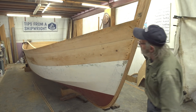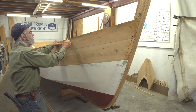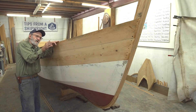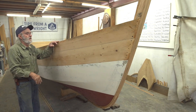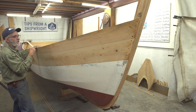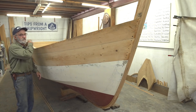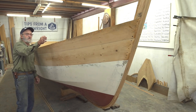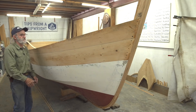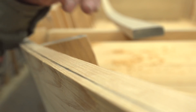Right over here I've drawn a line under the guard and I'm going to knock about a quarter of an inch off the top of the cedar plank right here to kind of tip the guard in a little bit, because I don't want them so slanted out. Most round bilge boats, where the guards are — especially amidships and working stations — the shapes are plumb on the outside, so the guards go on plumb. But these ones I just don't want them tipped out quite so much.